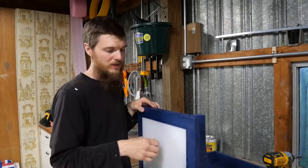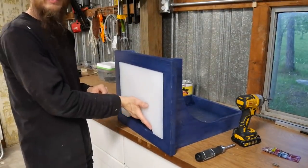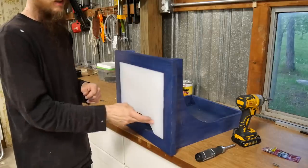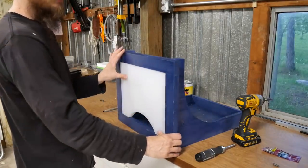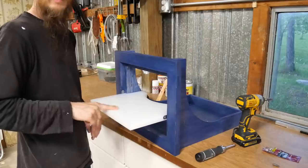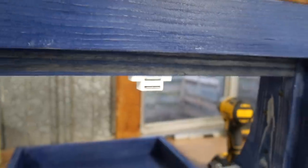And I just did one final upgrade, which I'm gonna show you guys, which is, check this out, looking good, but it's not falling anymore. What I did was, I put a little magnetic latch right there, so it just stays. And it's got some good holding power, but if you push on it on the bottom, you can tilt it out. And that's pretty flush. I routed it in. So you can see, I did the same thing here as I did over here. I just took a half inch router bit and just flush set that into the plastic. Mounted an inexpensive magnetic latch up here. Done.